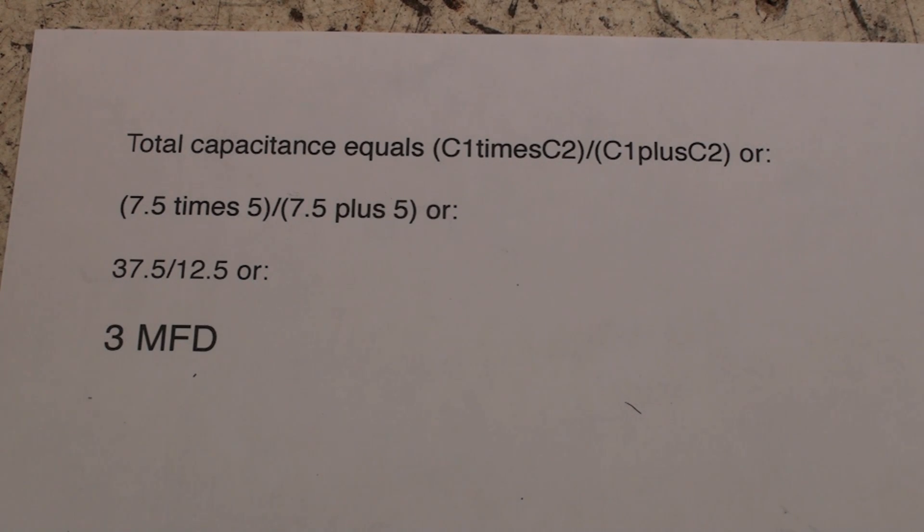This is just two capacitors. If you put three, it gets more complicated — I'm not even going to go into it now. It's all reciprocals, and I don't think it's worth doing for the most part. If I get a bunch of questions on it and people want me to do it, I guess I'll do it. But it's fairly complex, and if you get over two of them, the capacitance goes way, way down. Anyway, you could do two of them in series if you wanted to.